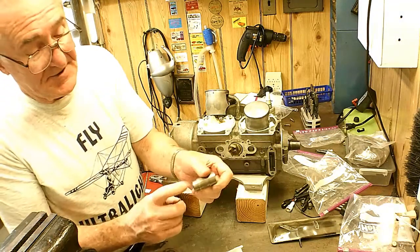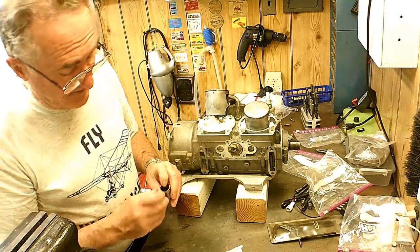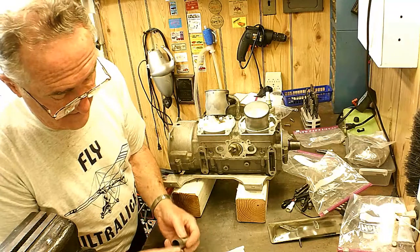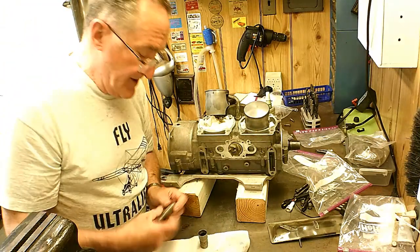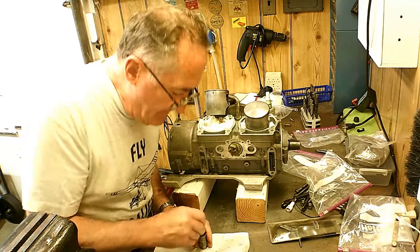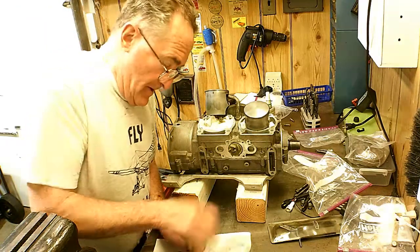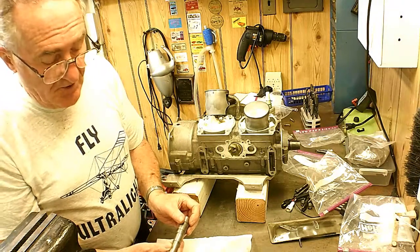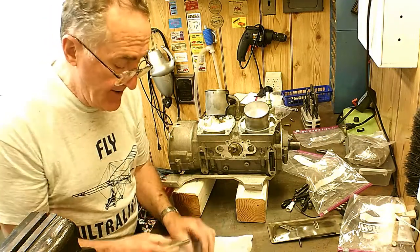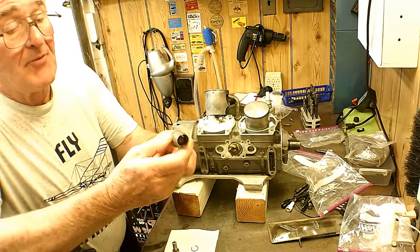What I did is I've got a little tool I made here. It's a hollow piece of tubing — it's got a little bit of a taper on this end. The idea is to put the snap ring down in there, and I use this end of it to kind of force that snap ring down in there, down that taper. You can see how it's starting in there. Once I get it down like that, this piece won't go through that tube, so I have to turn it over and use this piece — a little smaller diameter here — to get it down in there the rest of the way. The snap ring is almost closed.